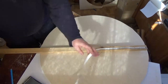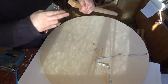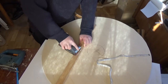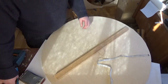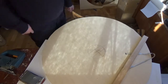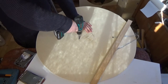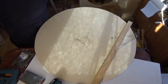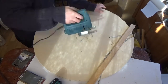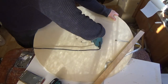This is just a wooden bar I use as reinforcement. I'm cutting it to size and sanding off the edges. This will also form the center grip of the shield. I got both this and the core material in my local hardware store, or Bauhaus. Now I'm marking where I have to cut, and I pre-drill some holes to get my jigsaw in there, and I leave a bridge in the middle of this hole so the center grip will be really strong and not just the wooden bar.